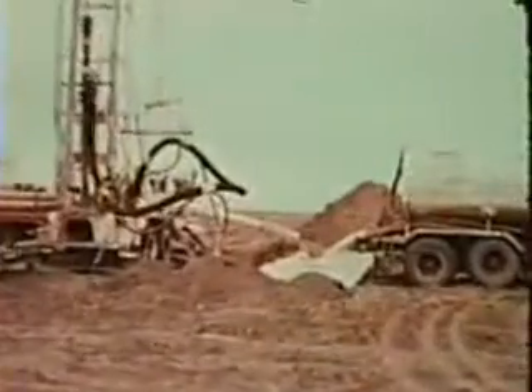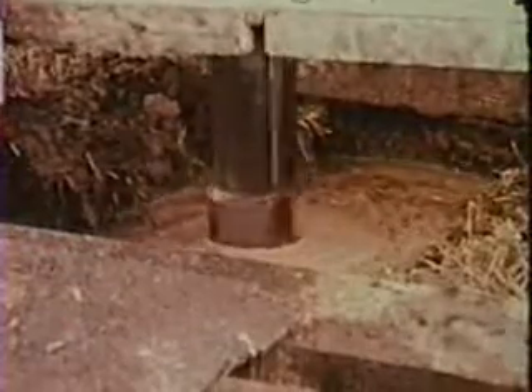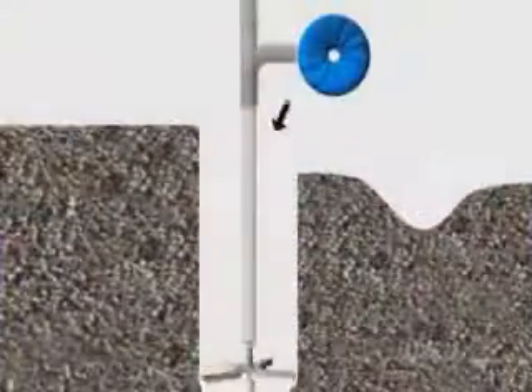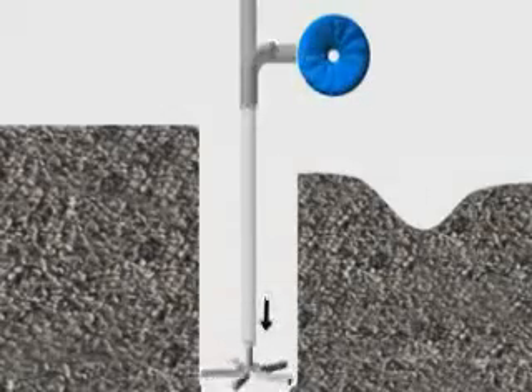This pit must be very large to accommodate a sufficient amount of fluid, which is required to flush the large amount of cuttings generated in drilling a borehole of this diameter. The excavated material needs to be replaced with fluid as drilling continues, further increasing the quantity of fluid required for this drilling process.